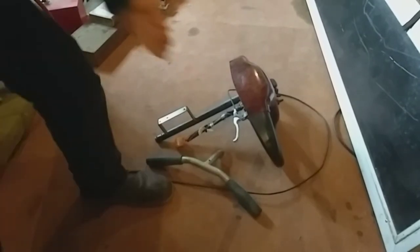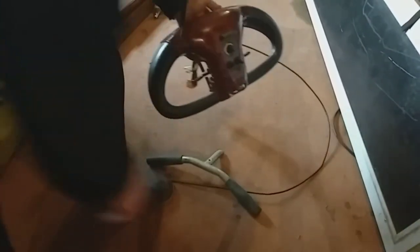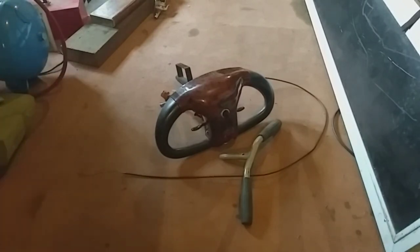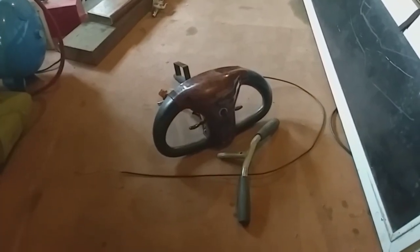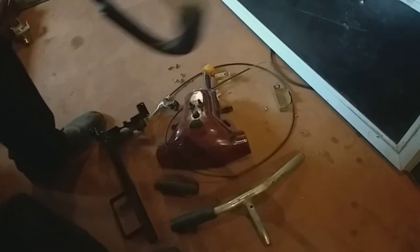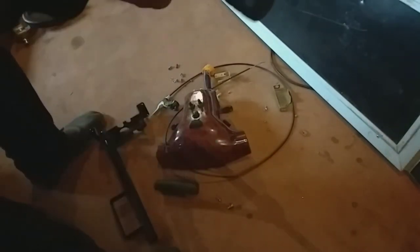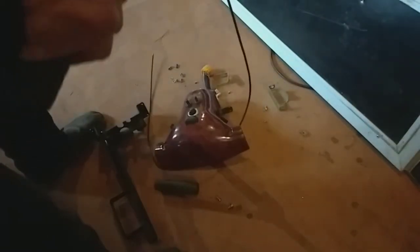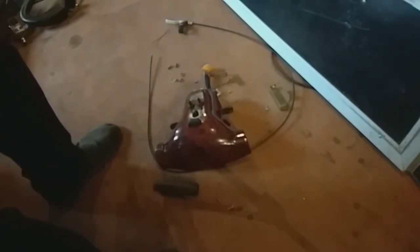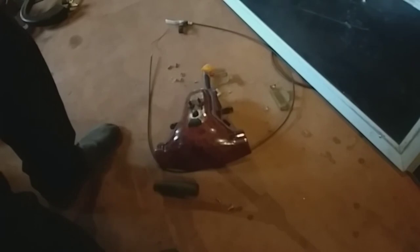This is the front of the Cordoba — big cumbersome thing. We're going to put the handlebars under there and chop half this off. I've took all that to pieces. This bit where the brake goes on — none of that's needed anymore. I've took the handle off there and we're going to fit the brake on there. This is the bit that wants cutting off here, and this needs cutting with a slot and welding up on the right angle, so that once I've cut this, it fits on the right angle and we can see how far back it needs to be.